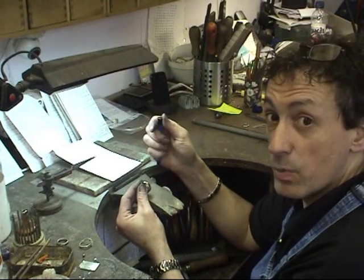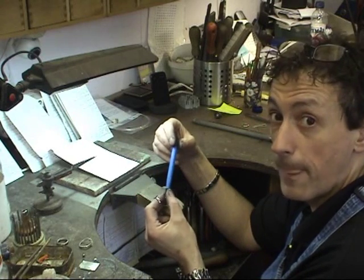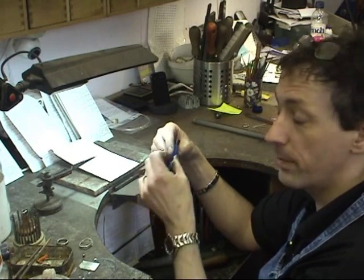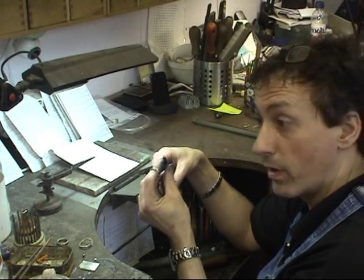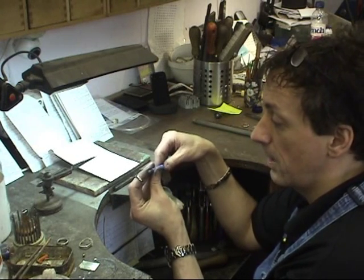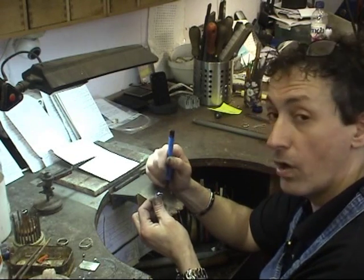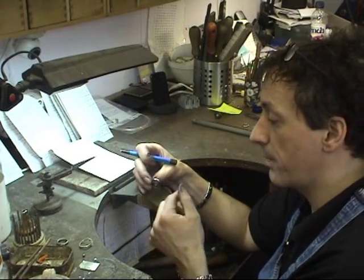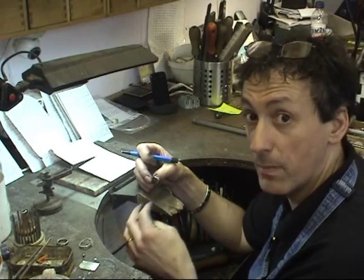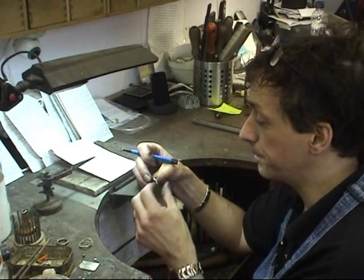And the quickest and easiest one that I think is by using what's called a glass fibre pencil brush. It's simply a brush, but with strands of glass fibre right in the centre. And all we simply do is use this to rub it onto the band. That'll get rid of the polish, admittedly, but I wanted to put that polish on there to make sure that there were no deep marks or deep scratches that will show through once the texture has been applied.